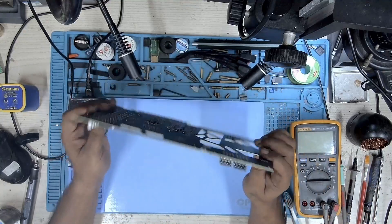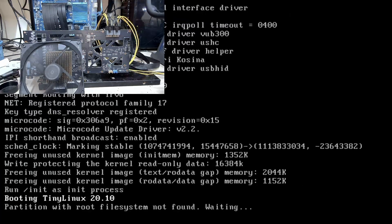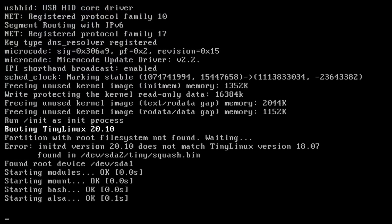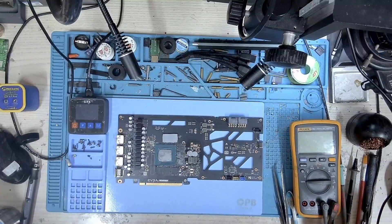Let's go ahead and put this card on our test bench and run MATS again. The card is on our test bench — let's boot this thing up. I'm going to run MATS now. The image you're going to see is directly from the card and not from the internal display. Now we have an image, which is a good sign, so I'm going to run MATS. There you go — MATS is running. Looks good to me and it's a pass.